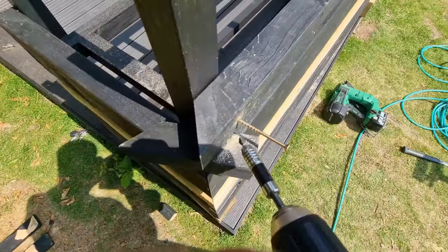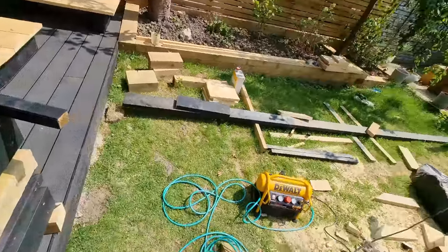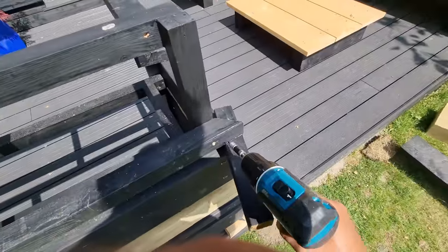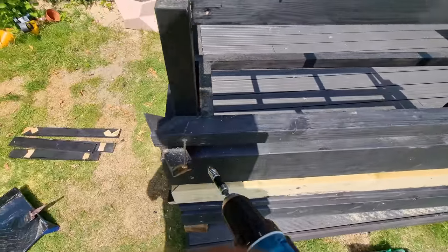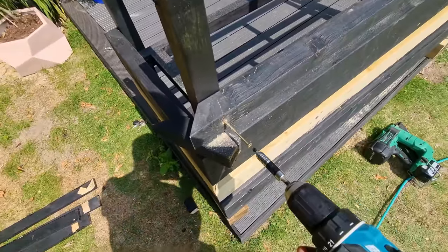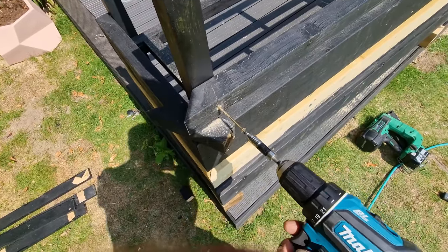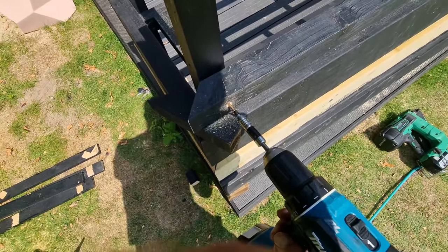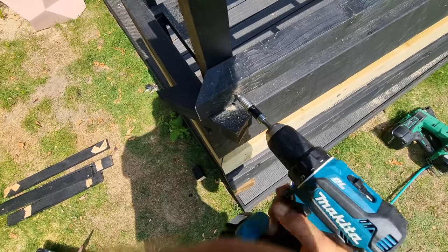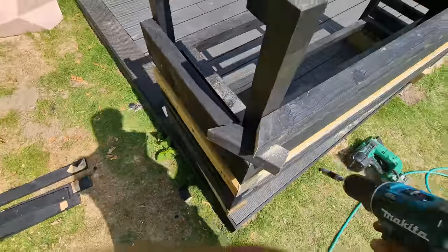get the sunlight maybe. So there's a big knot there. I haven't got another piece to use. No, not there, so I stuck a nail in it. Nail in the middle, no, not there. Big knot there. If I stick a nail in, it'll just probably either not go in or break the corner. So it's a screw on that one. So you can pilot hole it, clearance hole it.